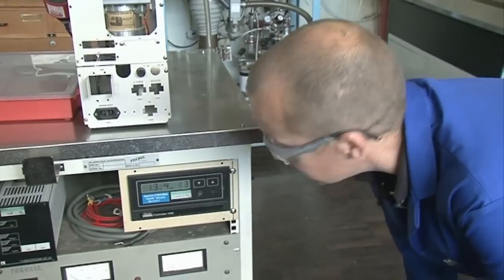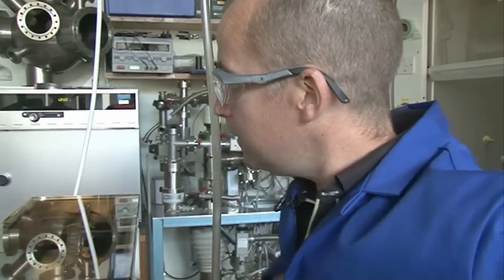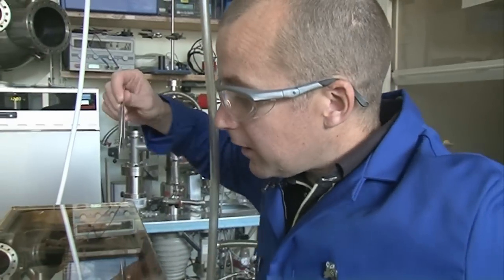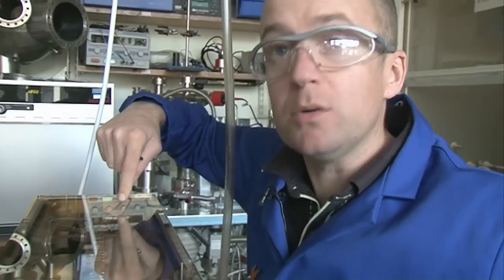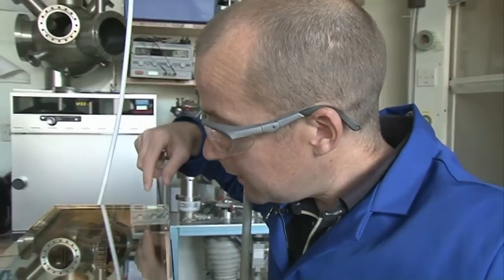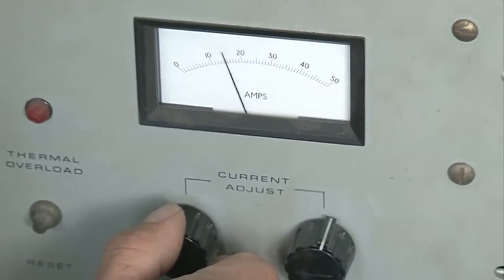So this is a really high vacuum now. I think we're almost ready to crank up the current between these two electrodes. Going to heat up that bolt in there where the gold is sitting on, and we're going to evaporate the metal onto the watch.